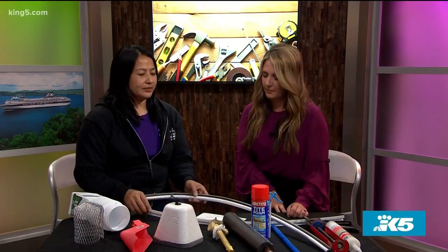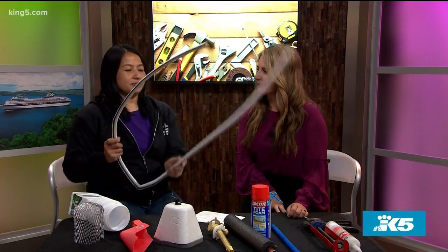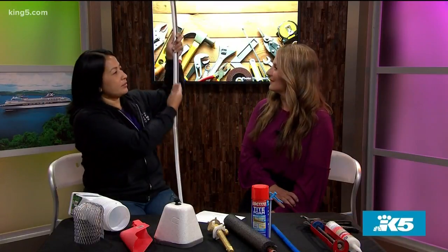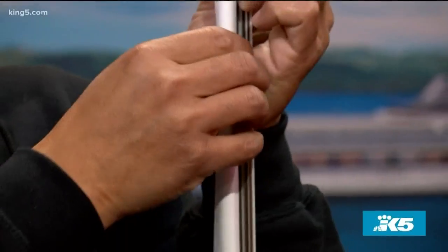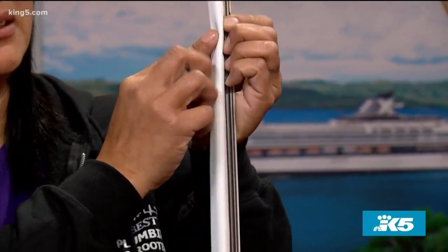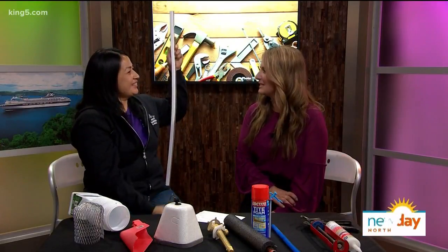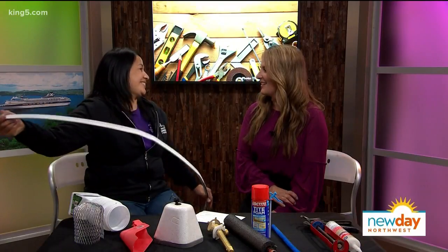The last thing is for your doors. You could buy this weather stripping and cut it to length. In your door jamb when you open your door, there's an insert — that's the weather stripping. All you have to do is peel the old one out and stick the new one in. Easy peasy — and you're going to save so much time, money, and headaches later.